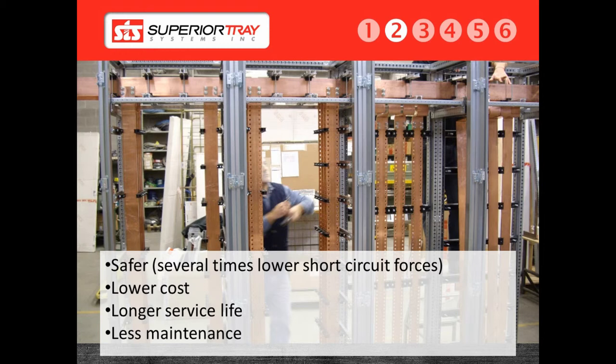The system has been in service and problem free for over 12 years now. Another solution for toxic environments is to use a non-metallic housing. Instead of using fiberglass, which is too brittle to withstand the sudden shock load of a short circuit, we use a glass-reinforced high-strength polymer system. Generally, our polymer bus is just a portion of the cable bus system within the toxic environment, or in a situation where the cable bus cannot be conductive,